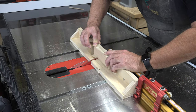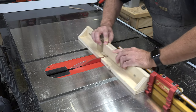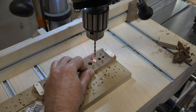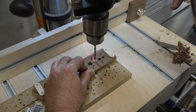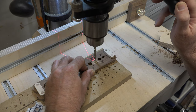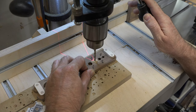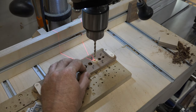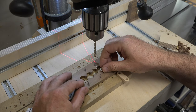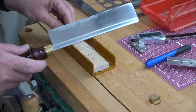Once the body shape is done, we need to cut the rotor blades. I use the small parts jig to cut each blade section, then take it to the scroll saw for final shaping. Making the rotor base spacer and the rotor blade hub is nothing more than cutting lengths of dowel using the small parts jig, then drilling out the center of each one. You're only using pieces of dowel that are one-quarter inch long and one-half inch long, so if the hole isn't completely centered, discard it and drill another one.